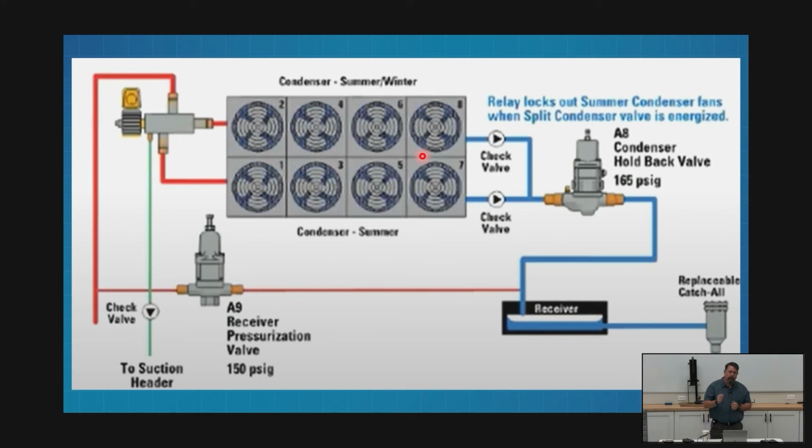All right, so what determines when refrigeration stops working based on discharge pressure? Any system, doesn't matter what system, right? At what point, if my discharge pressure falls, does that system stop refrigerating? When you stop getting pressure drop across your expansion device. Bingo.